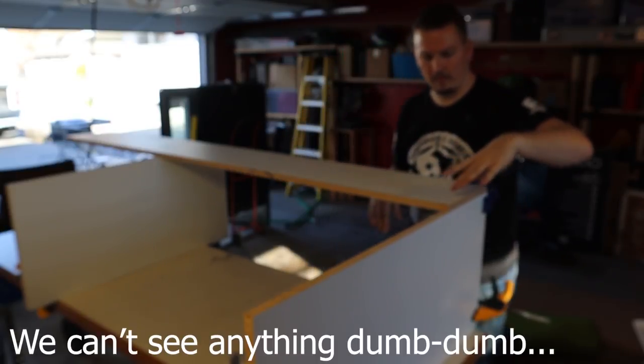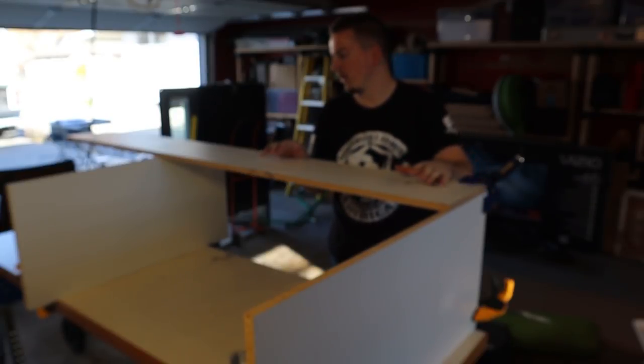I was able to build this entire rack out of three sheets of melamine. If I wanted to do closed sides, it would take at least one or two more. The way we're going to do this is: I'm going to get all four corners put on the top, then stand it upside down on my garage floor. I have lines drawn for three screw spots per corner, so there'll be 12 screws per shelf — plenty strong without splitting the shelf apart.